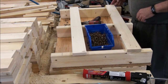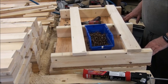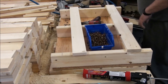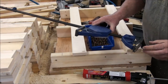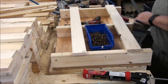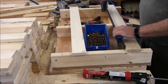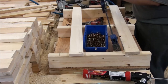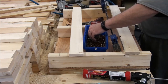Now I can see that this is sticking over here, so what's happened is either this 2x4 or this one is leaning in, or the plywood is just bowed a little bit. So we'll attempt to rectify that. Here's a clamp — it's a spreader clamp. I've turned this around so that the clamp will push things away from each other instead of pulling toward. I can put it to multiple places. Tighten it a little — you don't need to push it far — and now that one is perfectly in the right place as well.